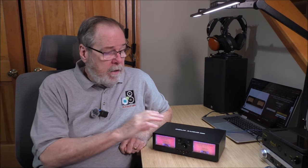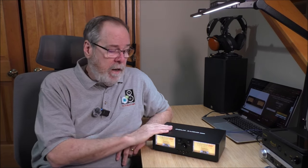It'll handle 350 watts of power incoming and it does have level matching. So let's say you have one amplifier and two pairs of speakers, and one pair of speakers is 3 dB more efficient than the other — we would perceive that as a doubling of volume. We can level match and make an apples-to-apples comparison. I typically used it with two amplifiers and one pair of speakers, where one amplifier might have a little more gain, and I can level match for a fair comparison.